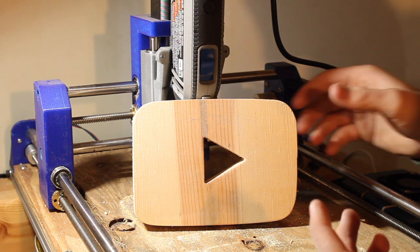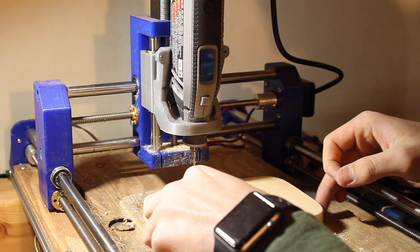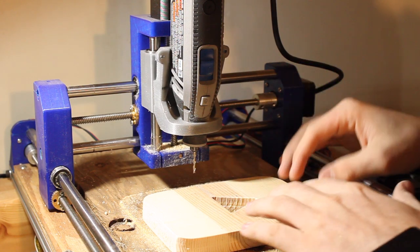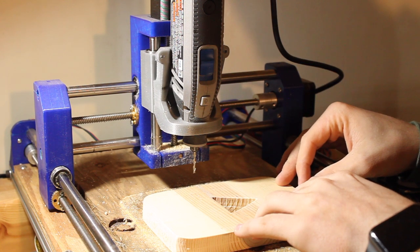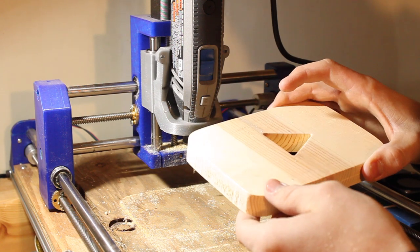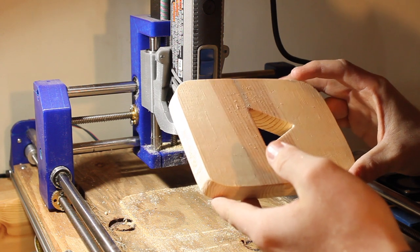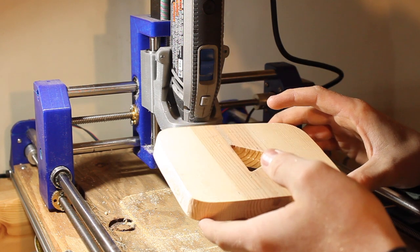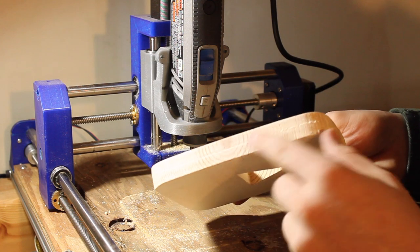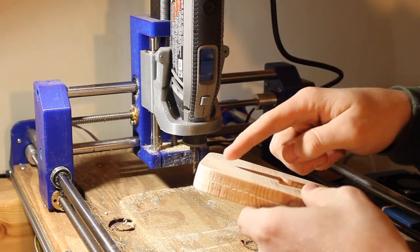Overall I'm pretty happy with the result. I was planning to mill it one way but it milled the other way and actually bottomed out on one side about a half inch. It didn't turn out too bad — I'm pretty impressed. I could have gone quite a lot slower on the milling speed, and because it bottomed out it left some lines here because it wasn't consistent on every pass.